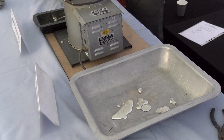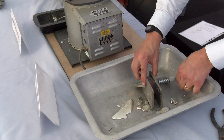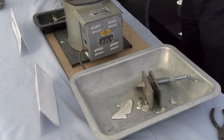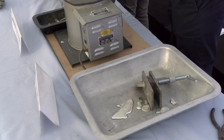How do you make the rubber mold? I start with my pattern - with these it's a shell or similar shapes. You make a Lego wall around it and set the pattern into Chavant - it's an oil-based clay, but plasticine works just as well. Then you've got your Lego wall around it, you pour the rubber on top, open that up, peel it apart, take off the Chavant, and pour the second half to make your two-part mold.